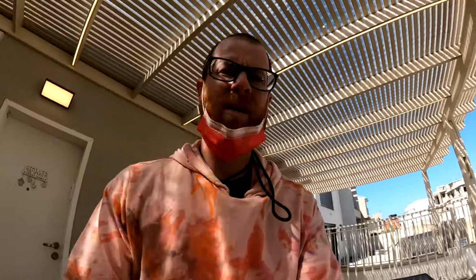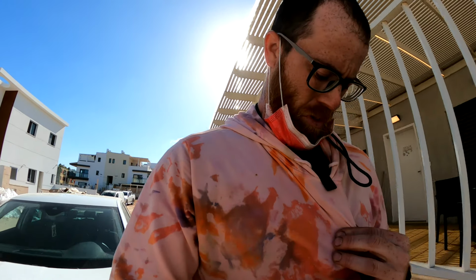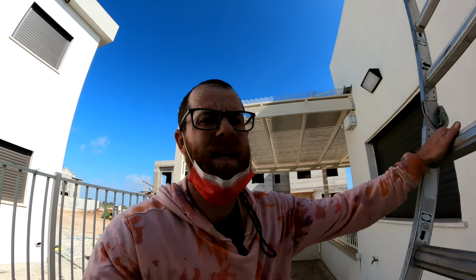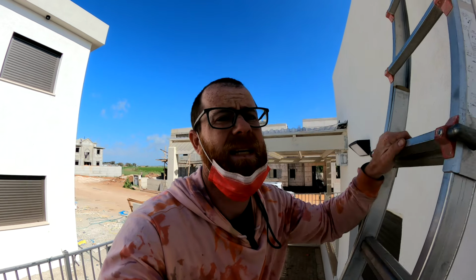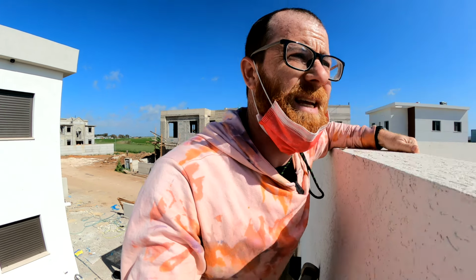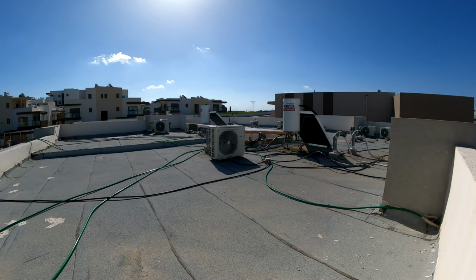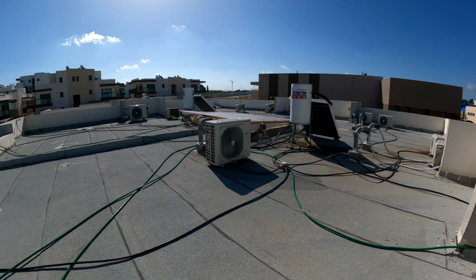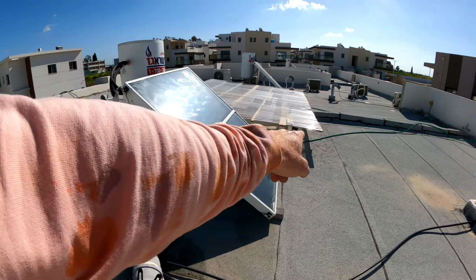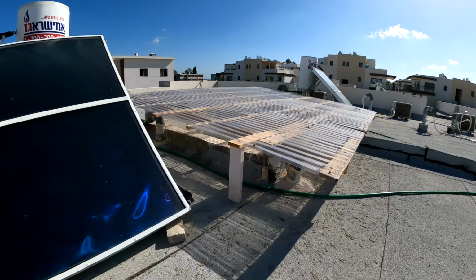And we go back on the roof. Let's go back on the roof. By the way, really important to notice is that that 3-inch line, as I said, no smoke was coming out. So that 3-inch line is either not our vent, and I don't know what it is, or it's clogged. So let's go see if we're gonna be getting any smoke out of here. Up and down, nice exercise. So this whole time we never had anything out of there. So that's interesting. So this either is our only vent, or that's non-working. Oh, there we go. We got smoke coming out.